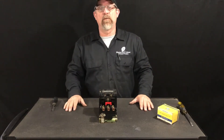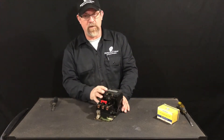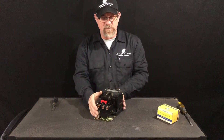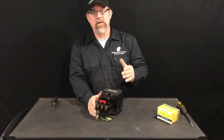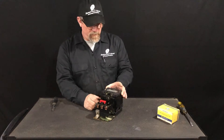Welcome back. We're going to pick right back up where we left off. Previously we had the Square D size 2 motor starter — got the same setup here, a size 2 — but today we want to go a little deeper. I'm going to show you how to change the operating coil out of the starter.